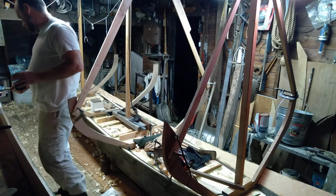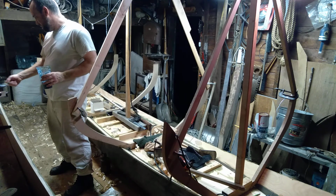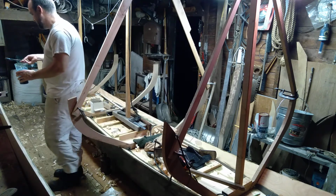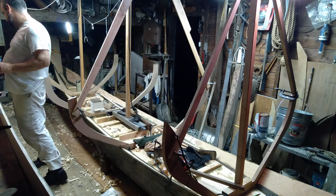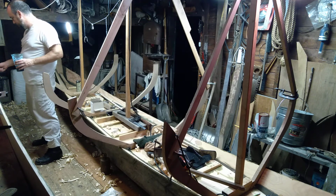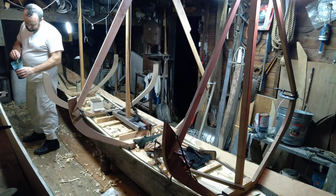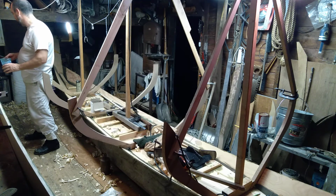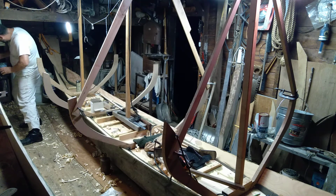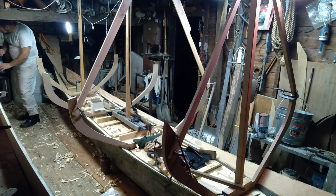And if you have to, you can sail it under just the main. But that jib really contributes to the maneuverability of the boat, the seaworthiness of the boat. With just the main, it can be difficult to fall off the wind unless you have speed on. Whereas if you've got the little tiny jib up, the jib doesn't create a lot of pull. If you get that little jib up, you can back the jib, and even if you don't have movement of water over the rudder and the centerboard, you can still fall off the wind.